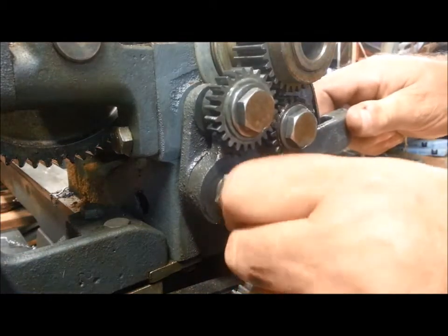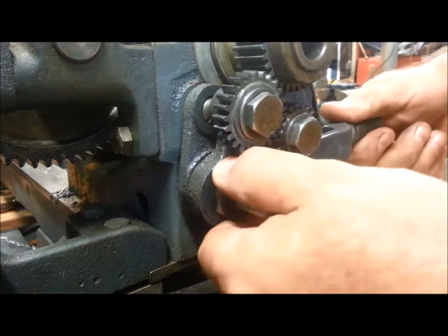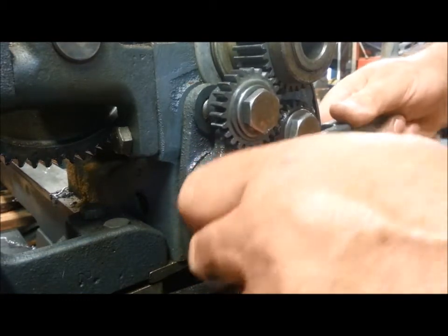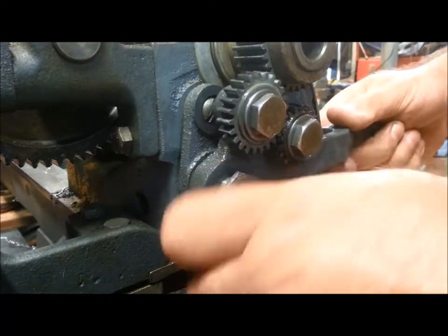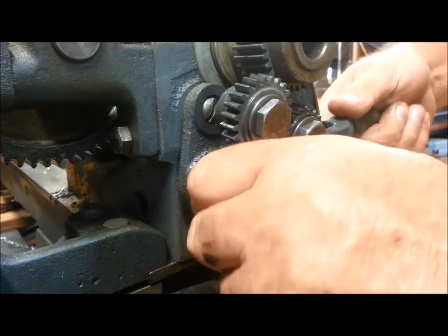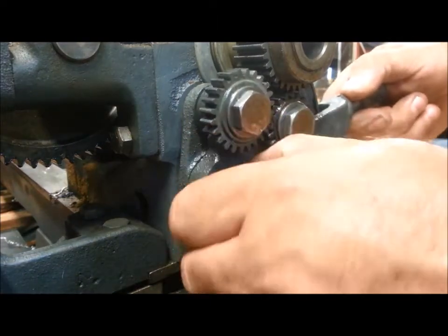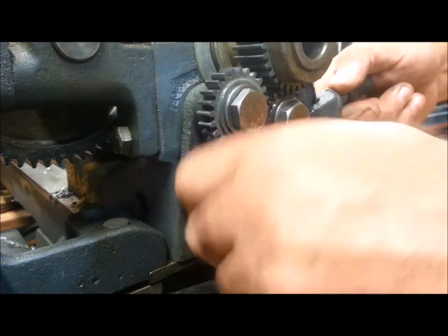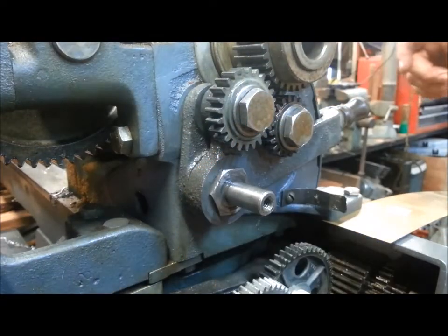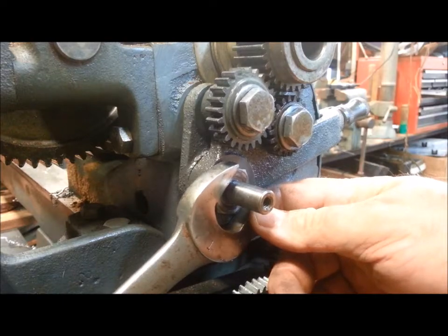I'm doing this project — I've thought about how to do it but I haven't practiced it, so you're seeing me discover the answer, just applying basic logic here. It seems like every time I look at this gearbox I find something that's causing noise, and I'm able to address it and it gets a little bit better and a little bit better. When I walk away from the gearbox, another thought will occur and I'll come out and check it. That's what happened here with this lash — I'd adjusted the lash of all the other gears but I'd never adjusted this lash in the proper way. I just wasn't happy with it. So I came out here at night in my socks and looked at it and it was like — yeah, that's a problem.